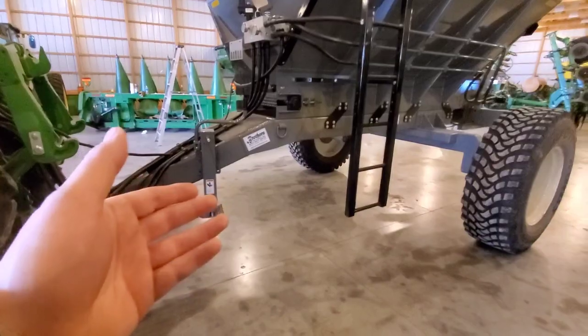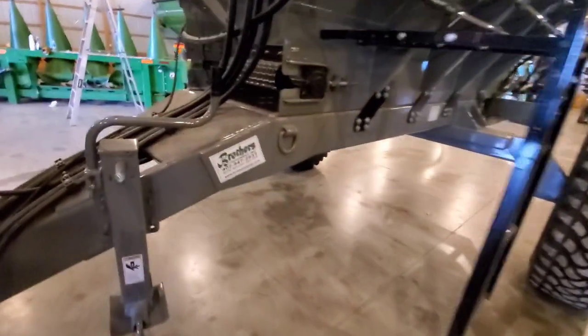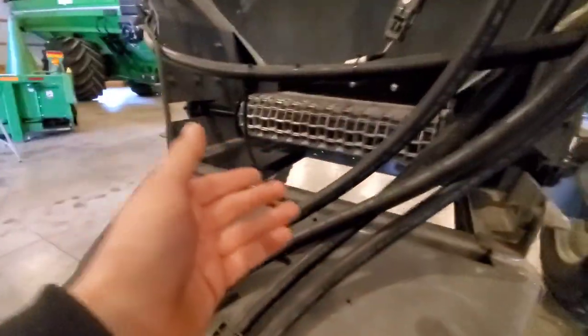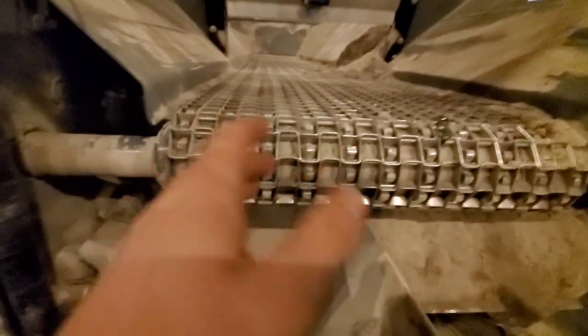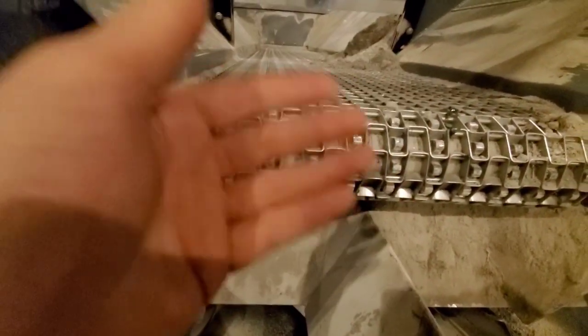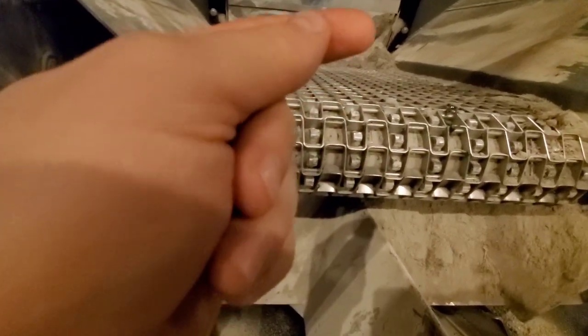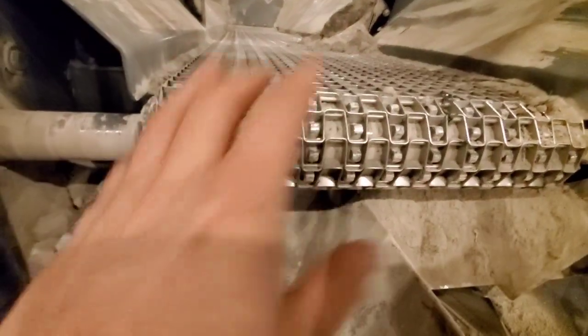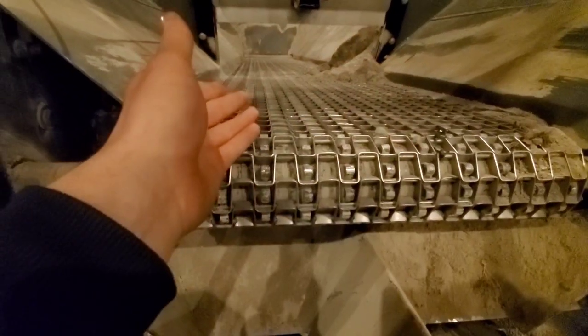A few chunks do not seem to phase the spreader whatsoever, so we're quite happy with the performance. I'll show you some features of the spreader. This is the high-lift on 120-inch centers. First thing you'll notice in the front is that this is a mesh chain machine — it's a 20-inch wide mesh chain, and that's kind of the secret to this machine for fertilizer accuracy. When we started looking at dry spreaders, we didn't realize how many varieties there were: bar slat chain, narrow bar slat chain, mesh chains, belt over top of chain, and straight belt.